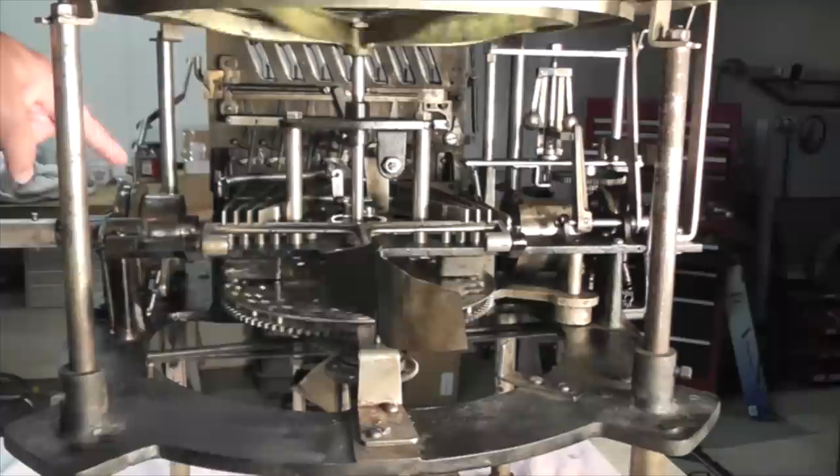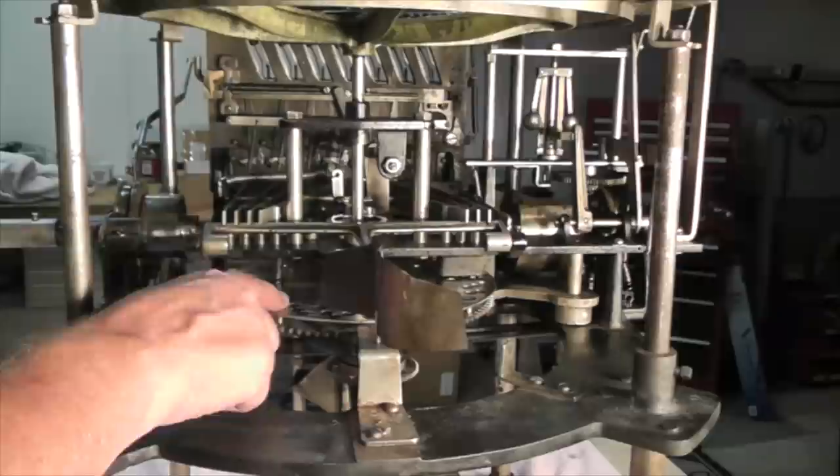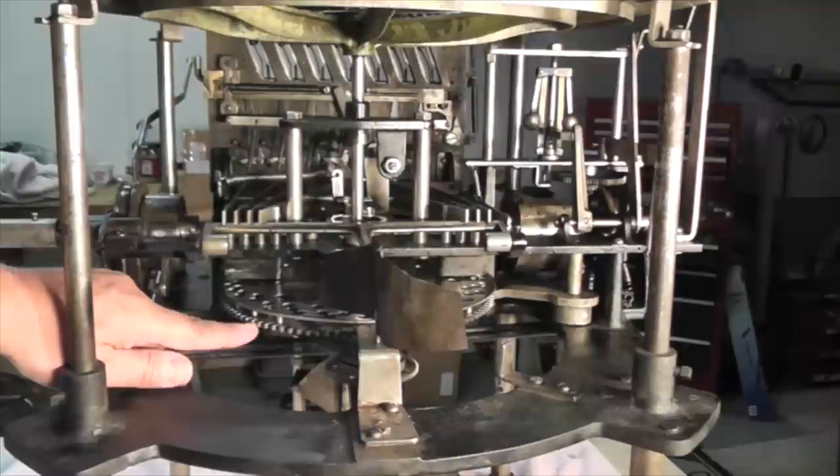So you probably saw the cam has spun about 220 degrees, which is a little over half a circle. It is now waiting for the ball to land in the ball detection lever. The wheel is directly connected to this disc here, which has holes in it, which is very similar to how a traditional three-reeler works. Instead of having three payout discs, it only has one though, because there's only one wheel. On the bottom of this is another large gear, which has tabs.